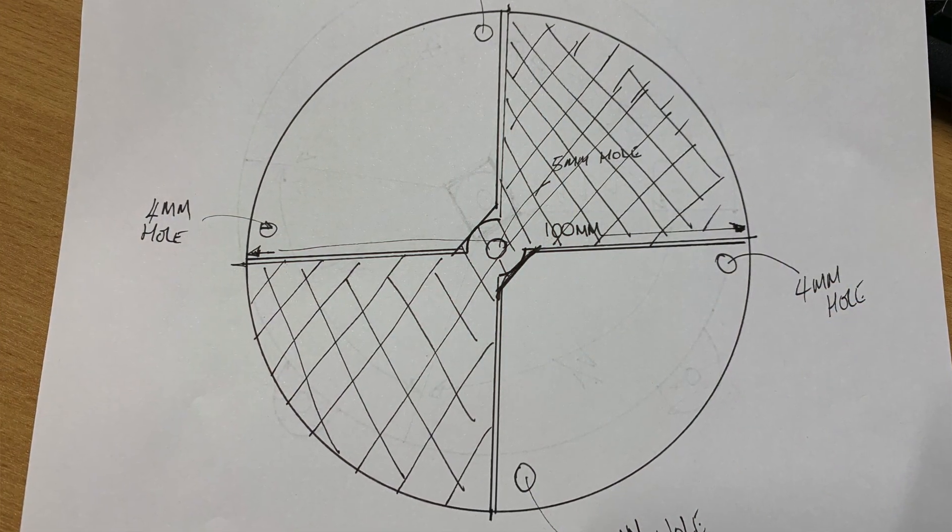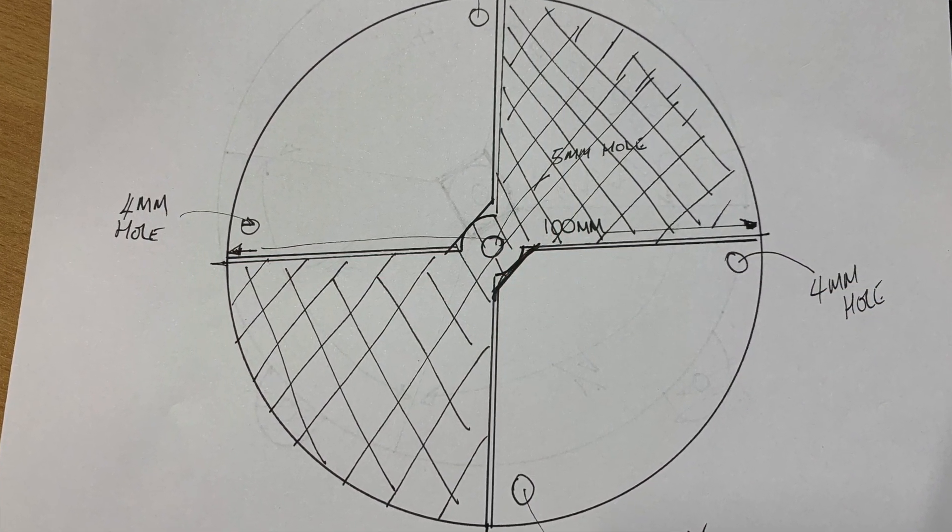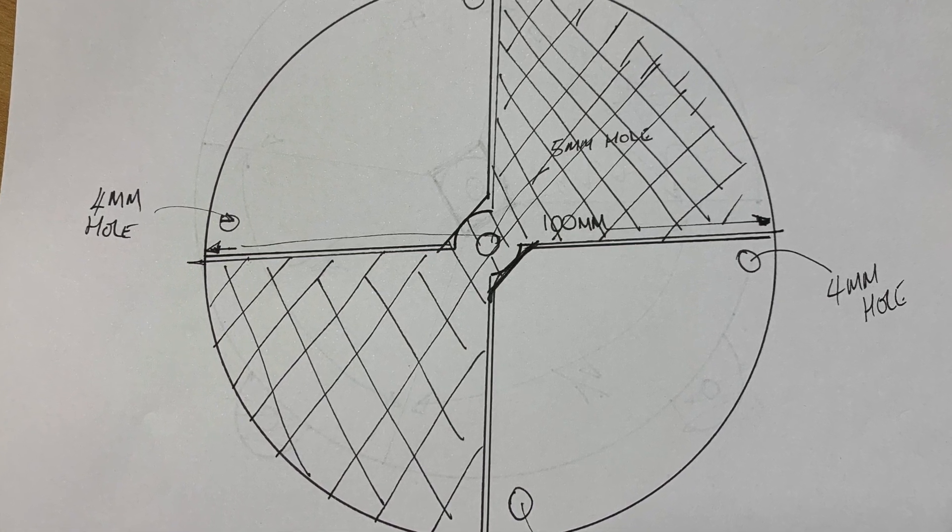For the handle or the knob, we're going to make one of those and stick it on to the capacitor. Now, as you know, I also have made a butterfly capacitor, which I will show you in the next bit. It's a little easier to make, to be honest with you, because you just simply use a 10cm hole saw to cut the aluminium and then cut the butterfly — or the bow tie — out of the middle. I won't show you the construction of that, but I will show you the capacitor. It's based upon one that was given to me by Andy in Cheltenham, so thank you very much for that, Andy. Let's proceed — we're putting the tuning knob or dial on and cutting the threaded bar to the right size.